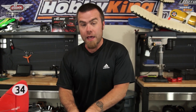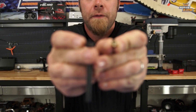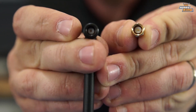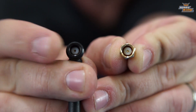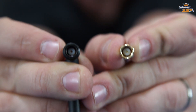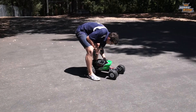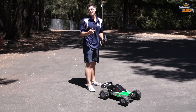So without further ado, let's get to your comments on the Boss Cam 5.8 gigahertz antenna daily. Robert Veach says please show us a close-up of the SMA connector — customers are asking what is the difference between RP-SMA and SMA. Good thinking! SMA is this little guy on the left with a skinny little pin right in the center of the connector that conducts things. This little guy is RP-SMA — reverse polarity — and as you see, the little pin in the middle is a socket instead of a pin. So SMA, RP-SMA. Thank you Robert, that was a good one.